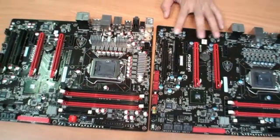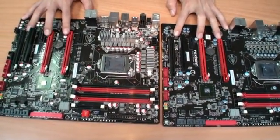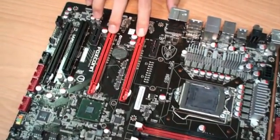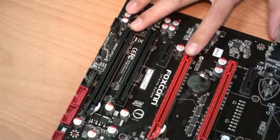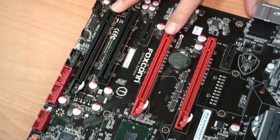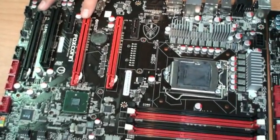The second feature is we have three PCI Express x16 slots. We can support official dual x8 solution, and the other x4 PCI Express slot can support a physics card or lower-end VGA card to get more performance benefit — VGA performance for gamers.